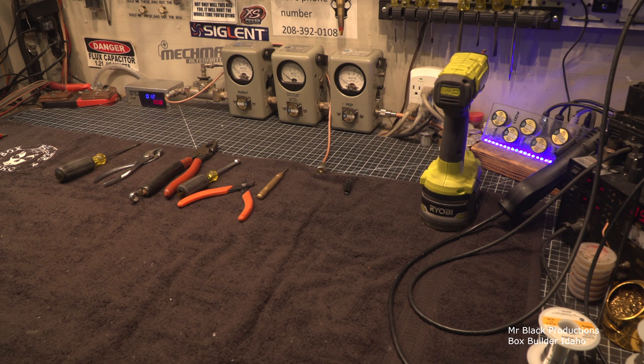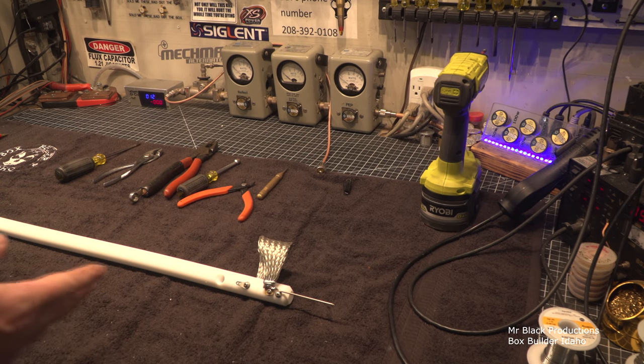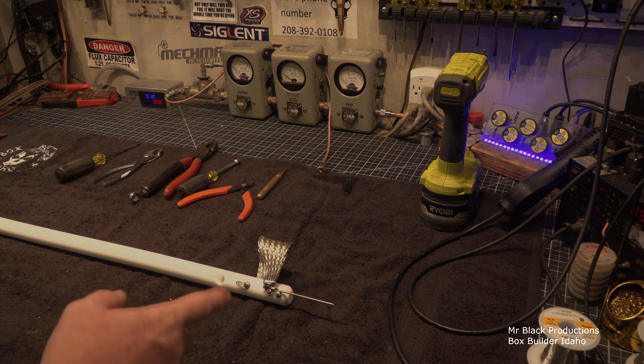And I mean this seriously. I joke a lot about things that only cause cancer in California. This is like the beryllium in the transistor feet. You don't really want to sand this. You don't want to turn this into a powder. You really want to try and avoid ingesting this into your body. That's with all seriousness attached to my heart with that tip.